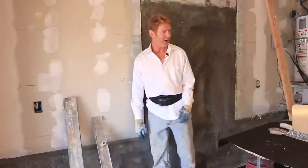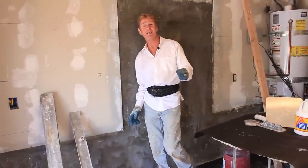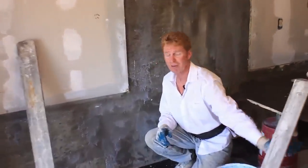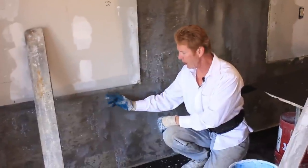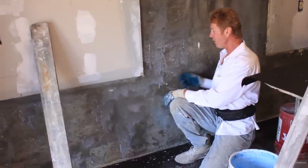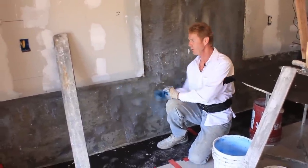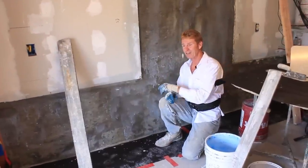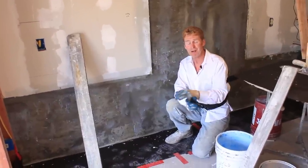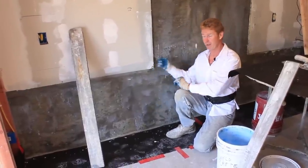We're going to use a five-minute mud. We were at Home Depot today getting some. What's five-minute mud? It means you've got five minutes to put it on — it's kind of like fix-all. When you mix that stuff you better be fast and know how to do it, and you've got to know how to mix it. Jay's gonna mix me up some. The five-minute mud is to give me some depth here. If I use a 20-minute mud, which I usually use, I could plaster all this and I'm standing around waiting for it to dry. So with the five-minute mud I'm just going to skim these real quick and bring it out to fullness, then switch to a 20 and do the finesse part. Also, if you have dirty tools, a dirty bucket, a dirty mix and paddle, that five-minute mud is now one-minute mud because you've compromised the integrity of the mix. Everything has to be perfect in order to get five minutes out of it.